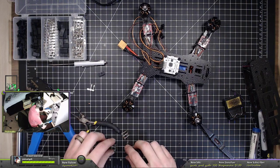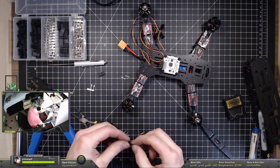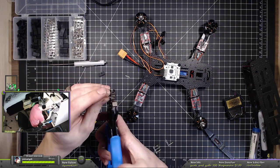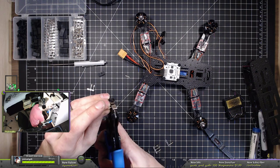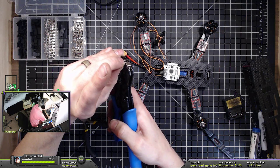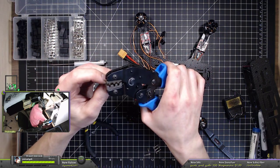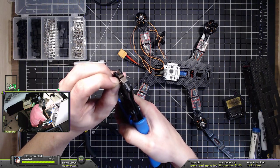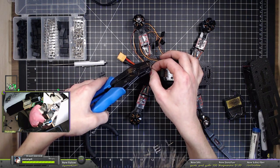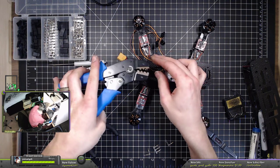Okay. So now, let's get our 2 DuPont connectors. There we go. We'll load it up in our crimper. And survey says twisted. Come on, work with me, buddy. There we go. Pull it out a tad bit. Okay. Slip the wire up in there until we see it sticking out the other side. Crimp away. Pop that out.